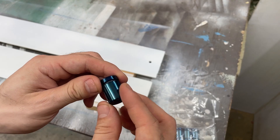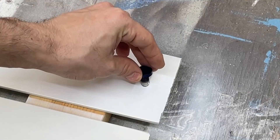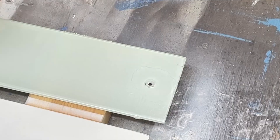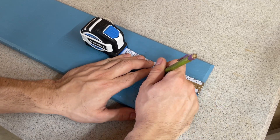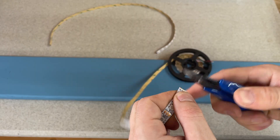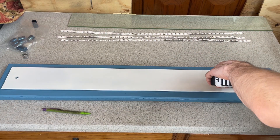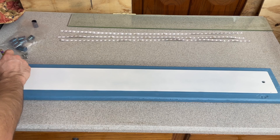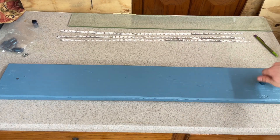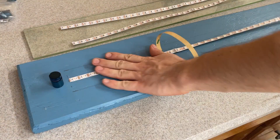To hold the glass panel above the LEDs, I am using 3-quarter inch by 1 inch blue stainless steel standoff screws that I got from Amazon. I had to modify the holes on the glass after receiving them, since I found out they were larger than I had initially calculated. Now it's time for the LED lights. I took measurements to mark out how far I could go with the LEDs, and began with 3 rows with 46 LEDs per row. I glued the LEDs to the wood using the sticky backing and soldered the rows together.